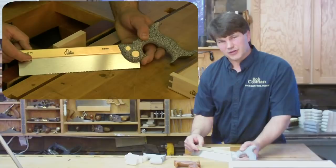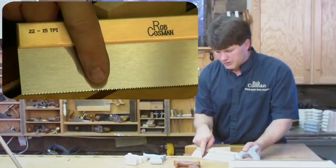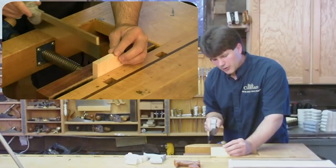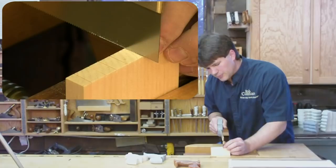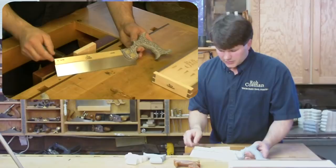Here's my solution, and here's my dovetail saw. We made the blade an inch longer. We made the brass back considerably thicker so it would be that much heavier. But what really made the biggest difference is the first two inches have little tiny 22 teeth per inch, while the remainder of the saw has 15 teeth per inch. Those 22 teeth per inch offer very little if any sawing resistance. So when you approach the wood, pinch it with your index finger and thumb to create that anchor point, press the saw laterally against them, just let the weight of the saw do the work. Use that first two inches to start the cut — all you really need is just a mark, just the beginning of a kerf. Then you move into the back teeth and it cuts with as much speed as you could possibly want.